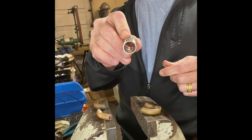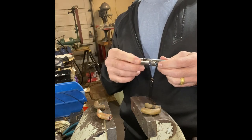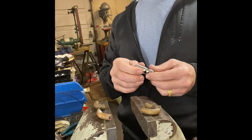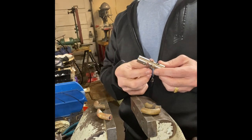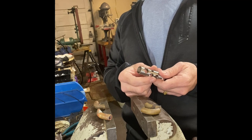Once these are drilled I sand the exterior of the part to remove the exterior burrs, and I run a reaming step on the inside to take care of the interior burrs. If you do not do that when you're building valves, you will likely have a liner that's going to fail — it'll tear away at that joint because the burrs are actually pushing through it during the balling process.